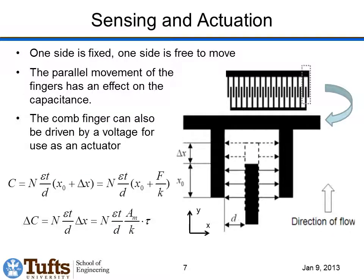This differential capacitance is easily modeled using a simple parallel plate model. Working through the mathematics, you can discover that over at least some portion of the range of motion, there's a linear relationship between the change in capacitance, delta C, and the applied shear stress to the sensor. There's a proportionality constant that depends on the thickness and the width of the comb gaps and other geometric parameters. This is only true if the finger overlap is kept within a certain range and the fingers don't move out of plane. The goal is to have a sensor which is linear over a large enough range to be used up to the 100 Pascal level.